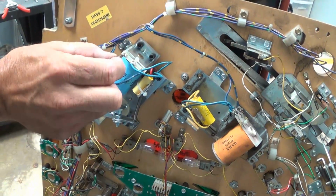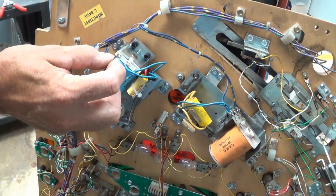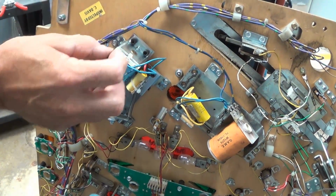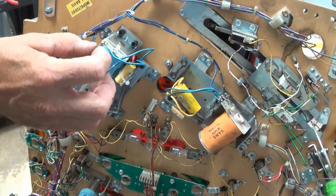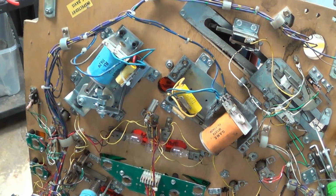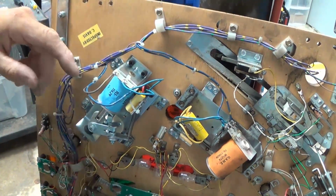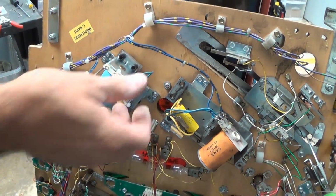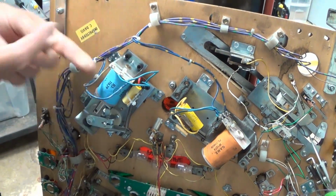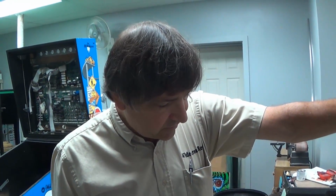I make it look easy with the soldering, but these wires get hot. Some people can't hold these until they cool off like this. You're dealing with 200, maybe 300 degrees here. So some people will choose to hold it with a pair of pliers or tweezers. But you can't just put the wire on and put the soldering iron to it; it'll fling away because the wiring is tensioned. So you have to hold it close to the end, and you have to tolerate heat. Well, it looked easy. After doing so many, it does get easy.